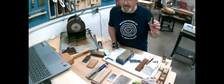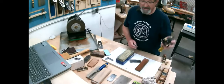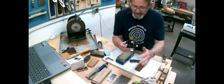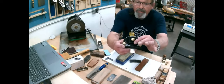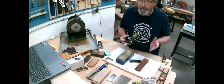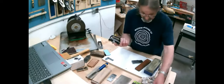It has another jig as well — a dovetail jig, which I just read about in the instructions. Anyway, this thing has another feature — we'll talk about micro-bevels in a little bit. You can move these little nuts to positions one, two, and three — they give you a slight difference in angle so you can get the main bevel correct and then add a small secondary bevel, called a micro-bevel. I do it by hand, but that's another story.